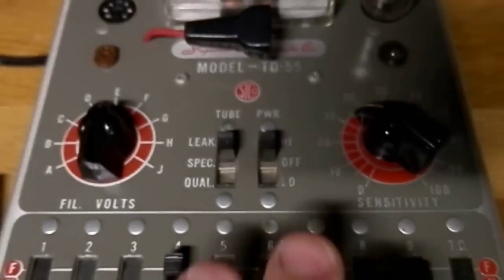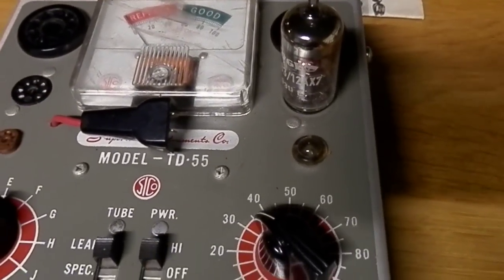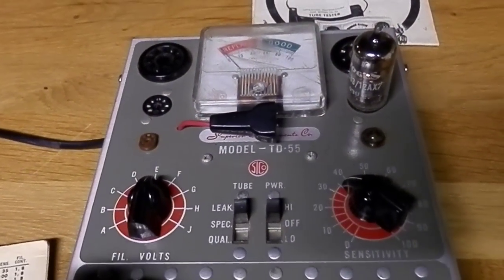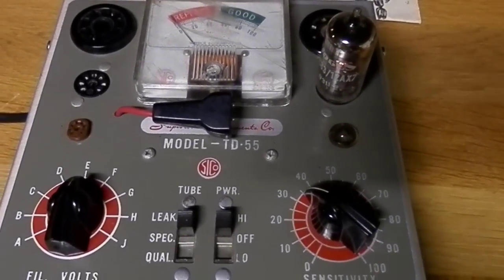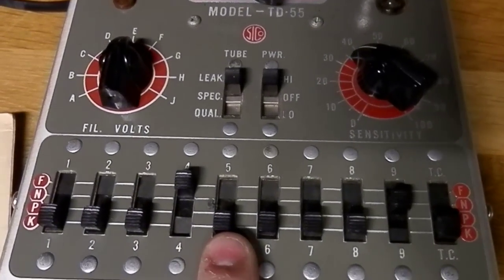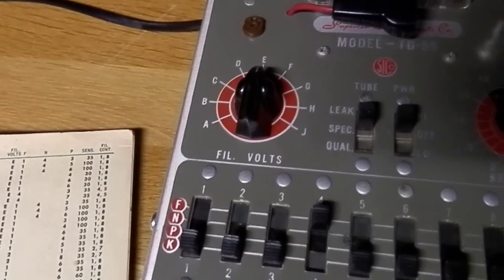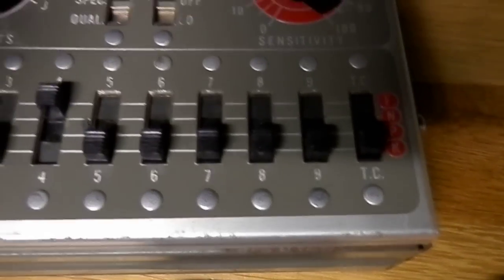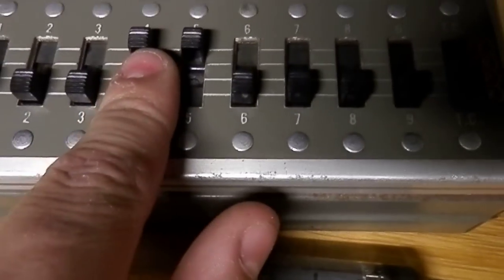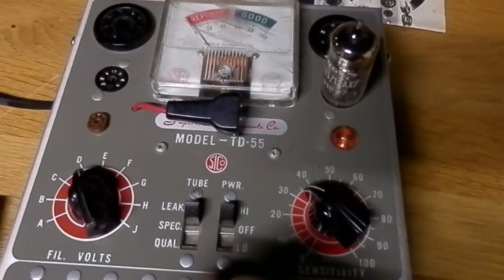This one has no star in front of it, so you go to high. By the way, this filament in this tube goes from 4 to 9 to 5 — it has a 12V winding. That is why 9 is not used, and this is on E. If you want to test it with the other place, you have to go to D, this to 0, to the K, and this to the F — but that is only for a double filament tube.